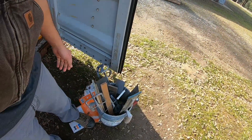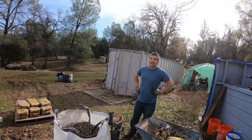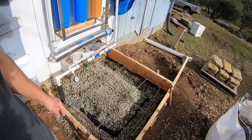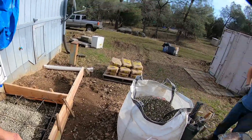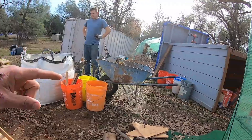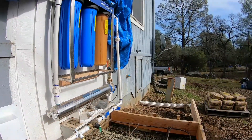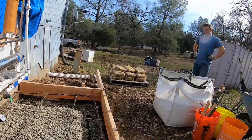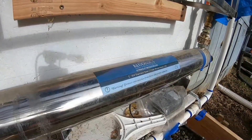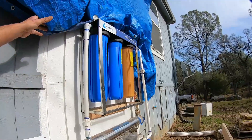We're checking on Jeremy's formwork here, which he did an excellent job on for his first time — he's a good listener. We had some leftover rebar and tie wire on the property, which we used — nothing goes to waste here. We opted for a slightly bigger foundation for the water filtration system housing. We have well water — pretty earthy — but it's doing its job. He has a Blue Onyx ultraviolet light to kill any microbial contaminants, rated for up to 24 gallons per minute, and we have it set to about eight gallons per minute.